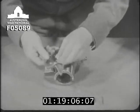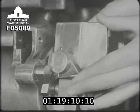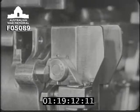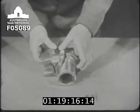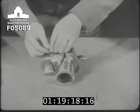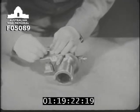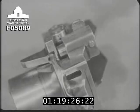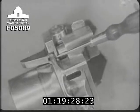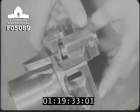Finally, the withdrawing lever is put onto this stud. You remember seeing the lever when we were putting the complete slide box in position. It's secured on the stud by this collar and pin. Notice that this roller on the withdrawing lever bears against the withdrawing lever plunger. That's all there is to the slide box.